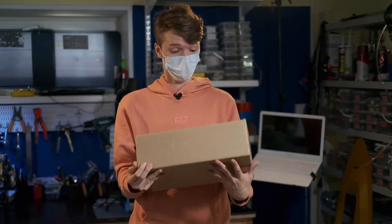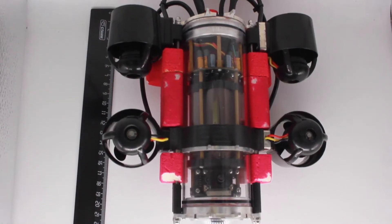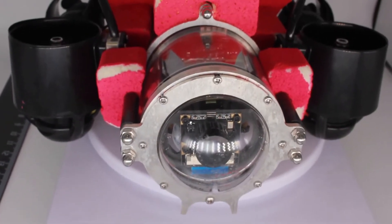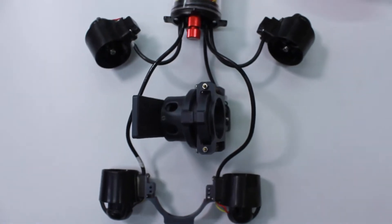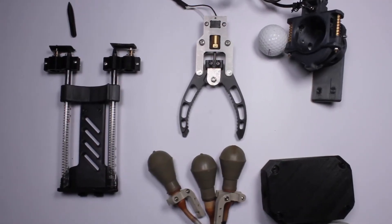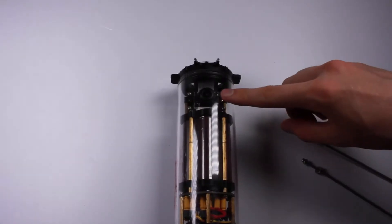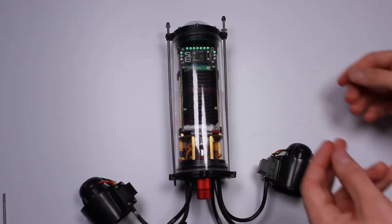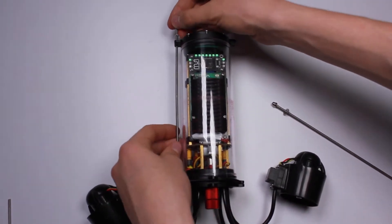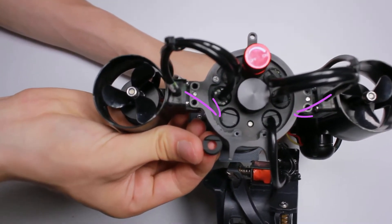Here it is. The weight is only 1 kg, and the dimensions are 250 x 200 x 90 mm. This became a serious challenge for us during the development of the payload tools. The main hull subsystems of the vehicle can be distinguished: sealed housing, buoyancy, thrusters, and payload. The enclosure and dome are made of acrylic, so that you can install two cameras — front and bottom — and watch the LED indication. The back cap and the dome are pulled together with pins, which preserve the integrity of the enclosure and make a chassis for installing the buoyancy and the tools. The cap has two sealed lead-ins for connecting the payload.